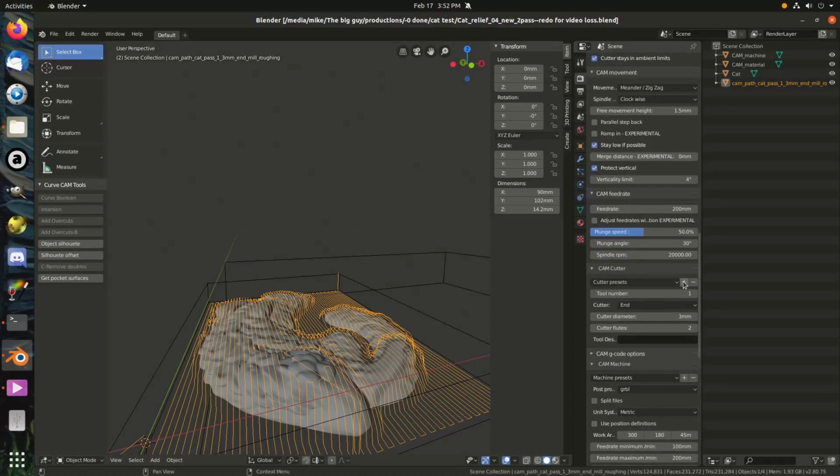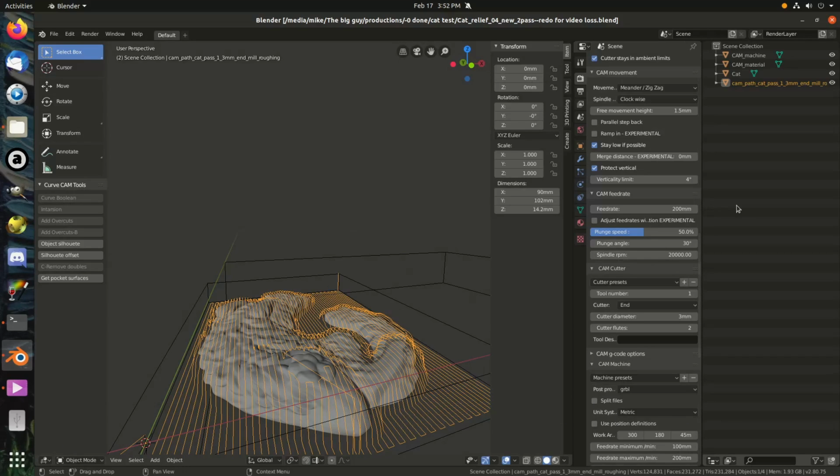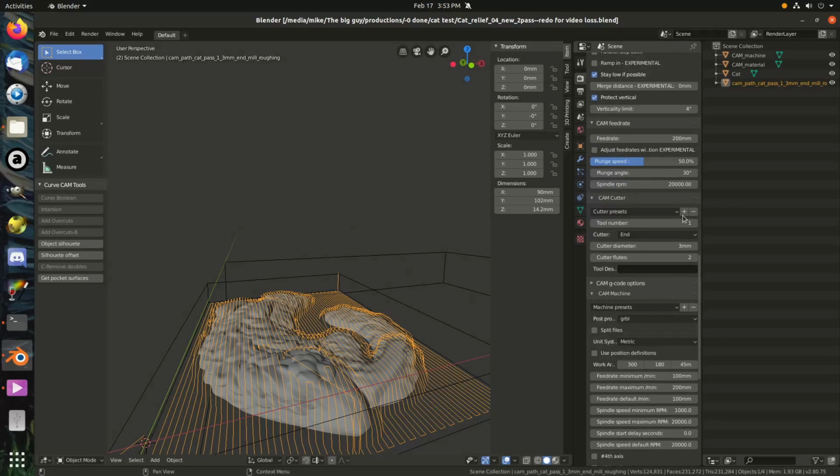Alright, so the 3 millimeter bit at the 200 millimeter per second was just killing that 3018. I'm not sure. It looked in the video like something was pulling the wire. I think it was just the resistance. That's kind of the small wire. I think it was just contorting the wire because of what was going on with that motor. I don't know. It definitely didn't sound good as soon as it hit. It didn't sound too healthy. That machine's not big enough to make sounds like that.